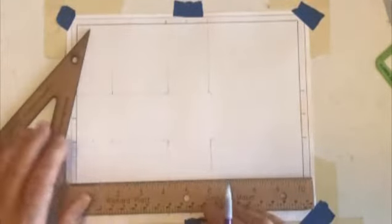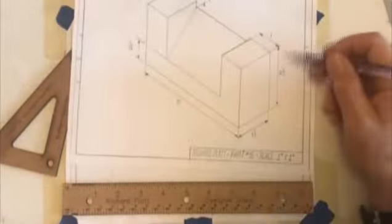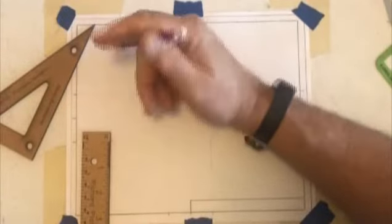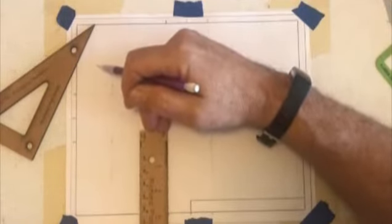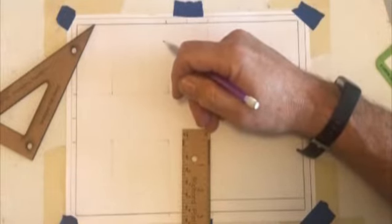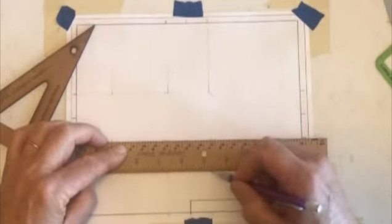I'll put it on this side so you can see a little better. So I've got the top and the front. I've got to work on the right. Now, the height of this part is two and a half inches tall. If it's two and a half inches tall, I divide by two — so that would be one and a quarter, or 1.25 inches. I'll find the top at zero, then one, and then one and a quarter, and I'll make a mark here. I'll come across to the opposite side and do the same thing — one and a quarter. I'll lay my ruler down and draw a line from here over to there.